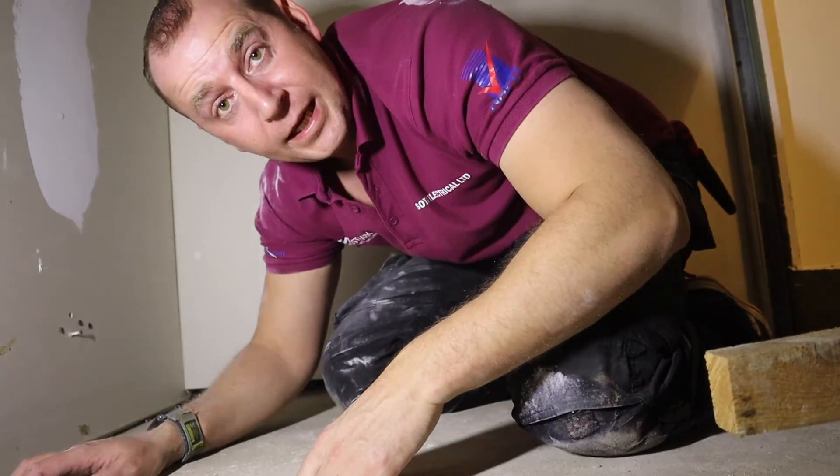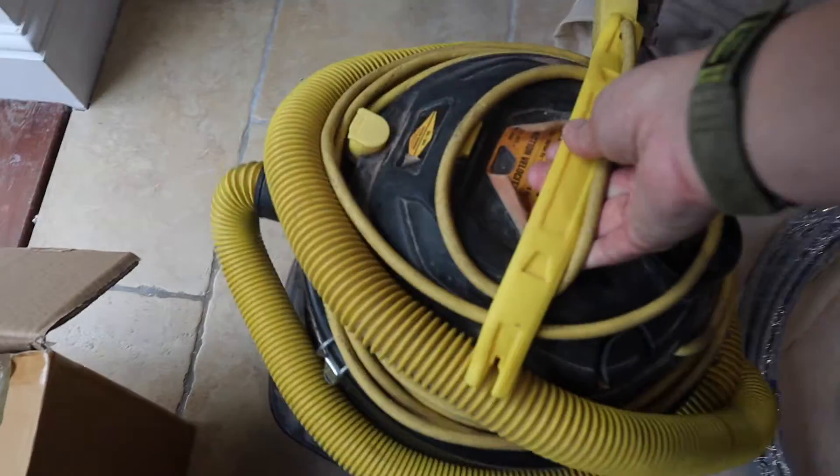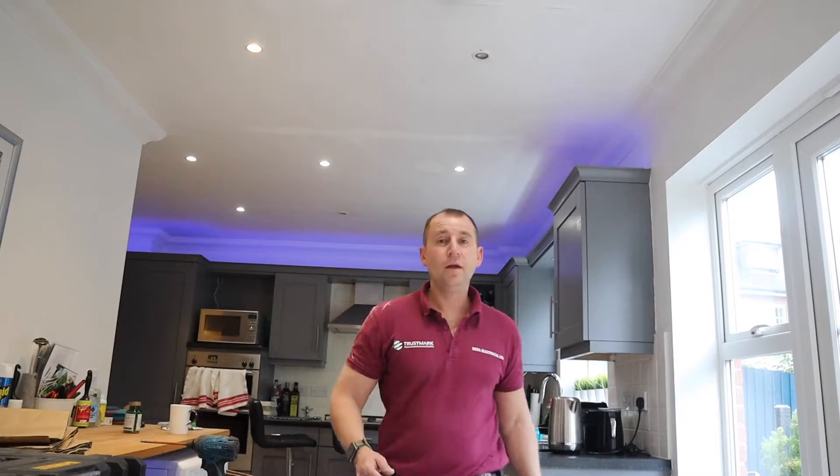Look at all this wasted space. One of the biggest problems I have is getting cables from the middle of a house to an external wall when I'm installing an EV charging point. I'm in a townhouse today. Here's the consumer unit. To get my cable out, I'm going to drill a hole here, which will get me into here, and then drill a hole there through here, which gets me back to here.